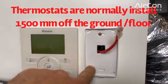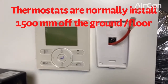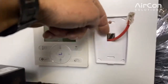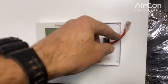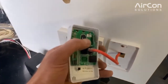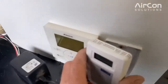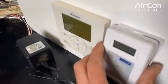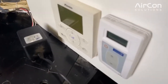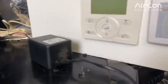When we install the wall controller, you'll find it in bedrooms, rumpus rooms, or studies. Ideally 1500mm off the ground — 1.5 meters — as a general thermostat height. We drill a hole in the wall, run the cable down the wall, and bring it out. This cable runs back to the zone motor. We plug in the RJ45 connector into the back of the thermostat, slot it in on the top, and click it on.